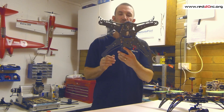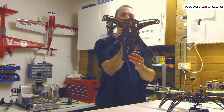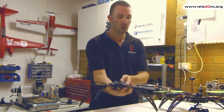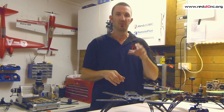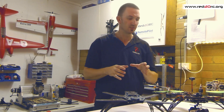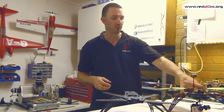It's a 450mm spider quad. You can see it's a spider configuration — it's actually only very slightly off of an X, so you won't need any special mixing in your flight controller. We designed it to be a competitor with something like DJI Phantoms or your 450 dead cat, anything in that size. It was designed purely around FPV gear and the Tarot 2D gimbal for the GoPro.